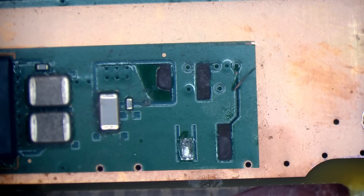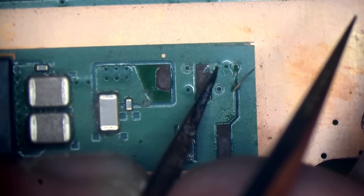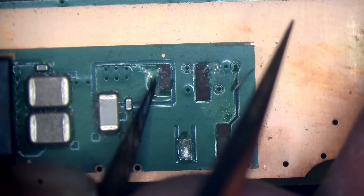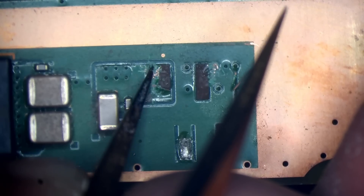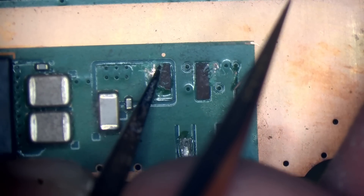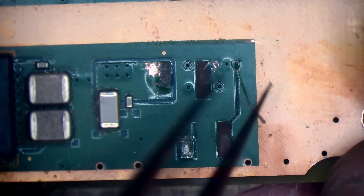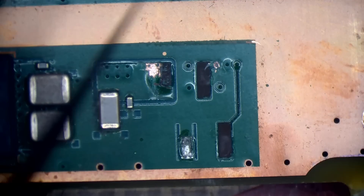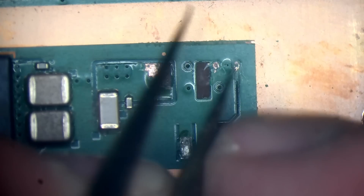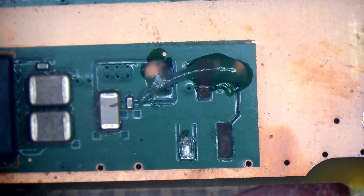Next we need to prep the board ready for the port's arrival — we need to expose the wires where the traces are meant to run to. We've got this one here, and this one here — most of the trace is there but we need to expose some of it just to restore this bit, because that's where the pin is going to sit. This one I can just bridge — I don't need to run a jumper to that one; it's close enough. The ground pad's still there so we can ignore that. This one we need to break the remainder of the trace away and just expose the via. Next we'll add some solder and tin the pads for the jumpers.